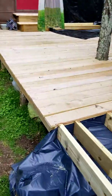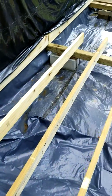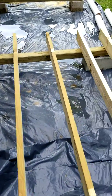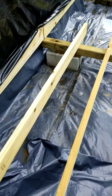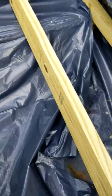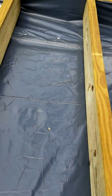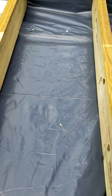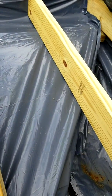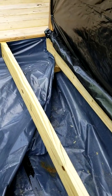This is a little bit different than normal construction. We have plastic on the ground and then, as you can see here, we have more plastic right here that's going to go up under the joist. We're going to put insulation between these joists, and we want this plastic because we want this really well insulated.